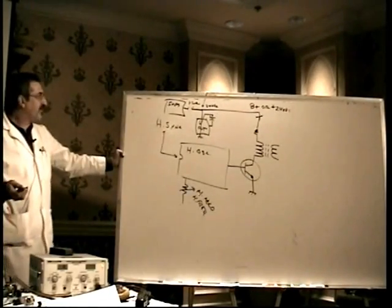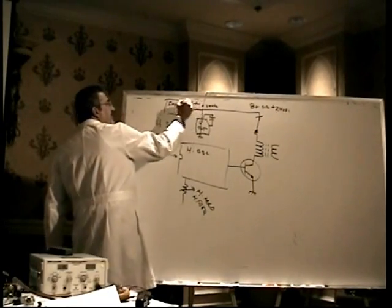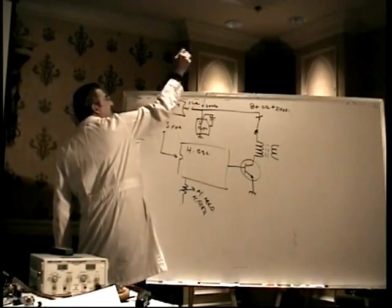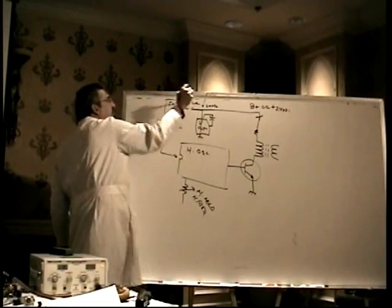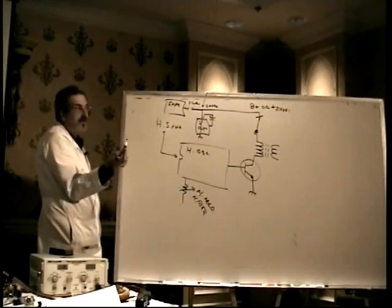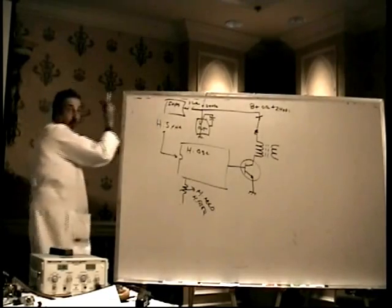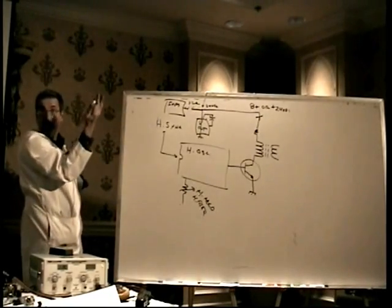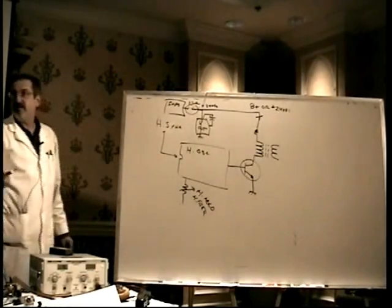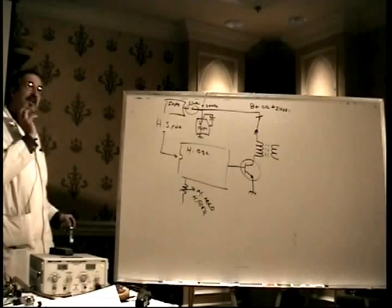So when you go through the power supply, when you're checking these voltages, if you could check on the other side of the resistor as opposed to that side, that's kind of an important clue, because you'll go, okay, I got my B plus, I got my 12 volts, ooh, my 24 volts is missing. Then you check the resistor and you see that it's open. If I have my 12 volts and my B plus, all the power supply is really working, isn't it? The primary side's got to be good. We have some kind of a secondary problem, and the only thing it could really logically be is an open resistor. So the first time I encountered that, I thought, isn't that interesting?